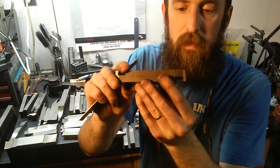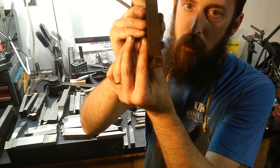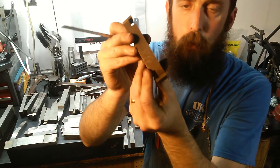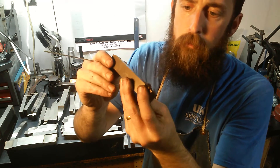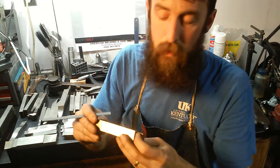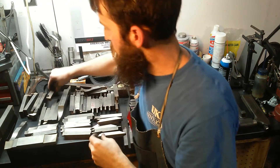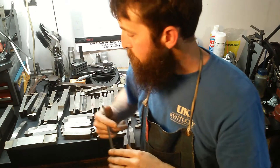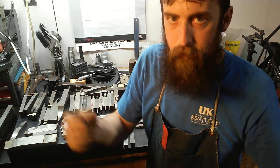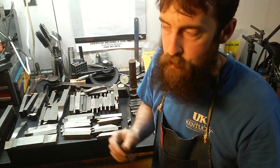Here's a side cutting tool — it would be really nice in the shaper. It's a Vasco Supreme, big three-quarter inch. Most of the tools you use for a shaper like this are going to be big — it's a big shaper and it takes big tools. That small stuff doesn't even fit in the holder. You have to put an adapter in there just to hold half-inch cutters — half-inch cutters are small to that shaper.